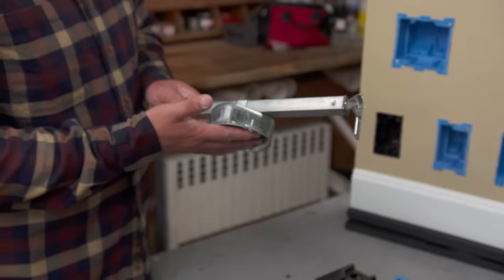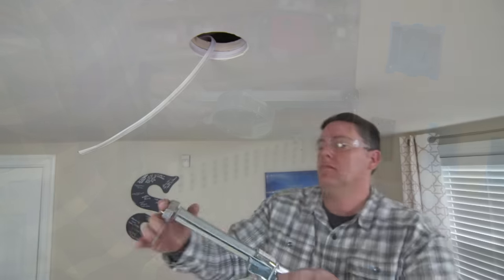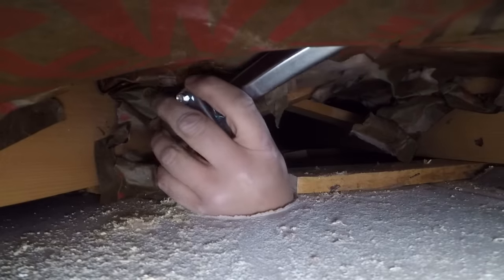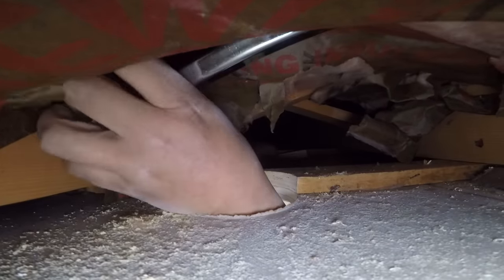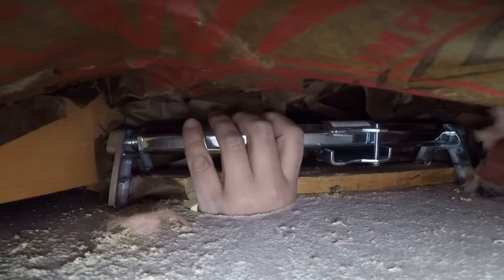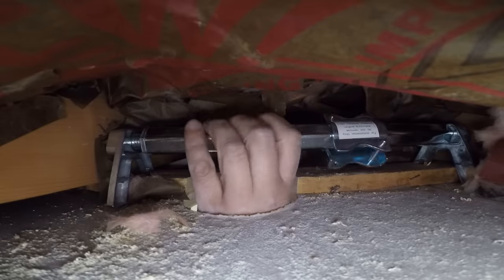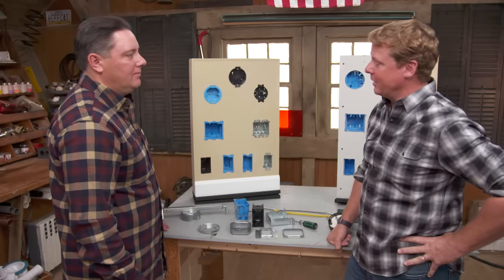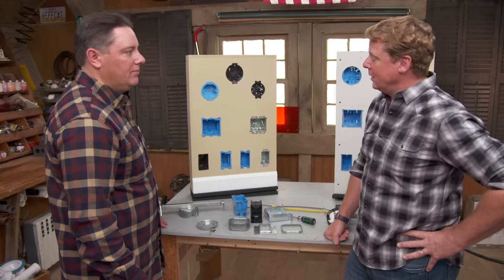Of course, no one's ever put structure in the center of the room where you need to put your light — that never happens. So in that case, that's when we come to this, which we've seen installed before. Same kind of box, but you'd cut that hole, slide the brace in, spin it until the two ends tighten up against the structure. Once that's tight, you can attach the box, and then you can still carry the weight of a heavy fixture or a fan. It literally expands into that gap and locks into the flanking joists, and you can move it left or right.